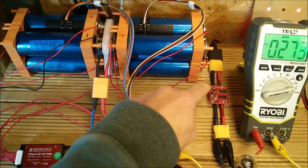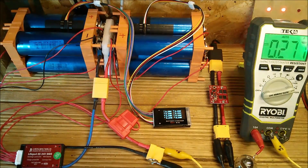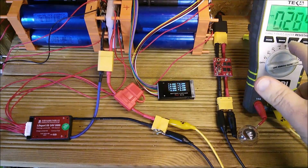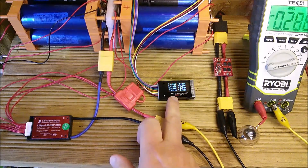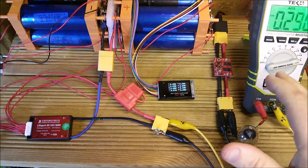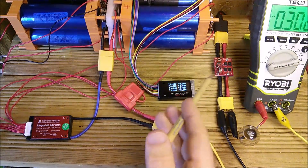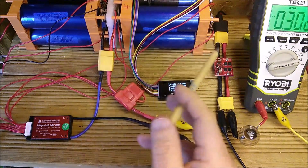This is it in position — the solar panel comes through the ideal diode into the battery, through a bulb as protection against something disastrous, and through the ammeter. There's only 280 milliamps coming in from the solar panel because it's very overcast today. What I want to see is when it gets dark this evening whether there's any back-feed current through the ideal diode — and of course there shouldn't be. If you're thinking the ideal diode isn't needed because an MPPT solar charge controller will handle that — well, I'm not using one yet.